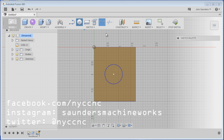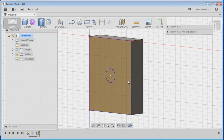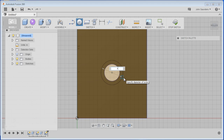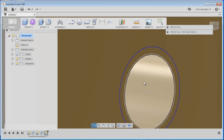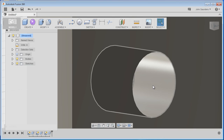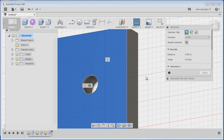So the first circle we'll measure as three-eighths, .375. Now we'll flip to the other side, select this face, and we'll create the .45-inch circle. Then what we can do is press-pull, and I like to click that and start it this way. We wanted .045 left, so that would be negative .455 in the math. If we check — click on inspect, click on that face and that face — .045 distance. Perfect.